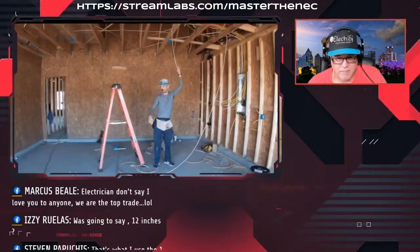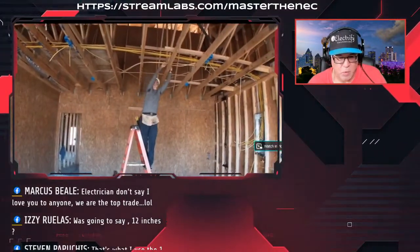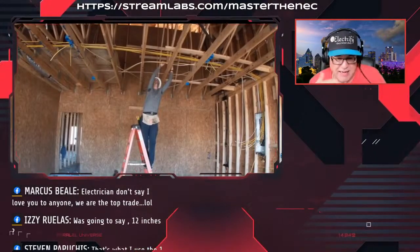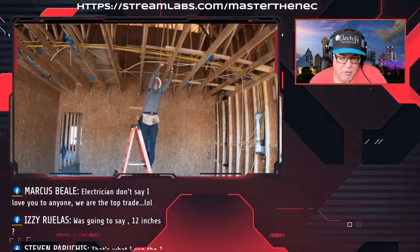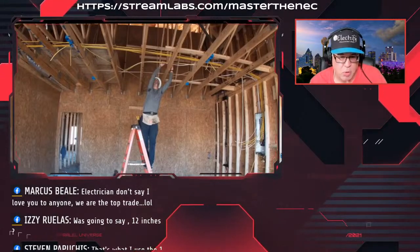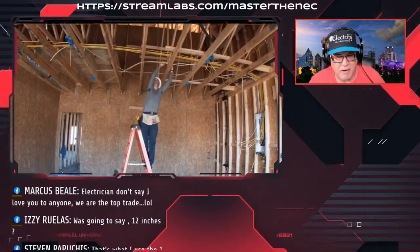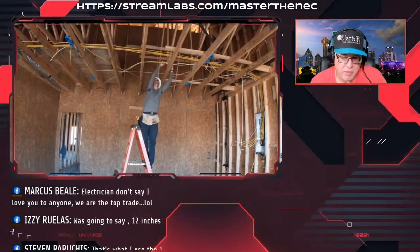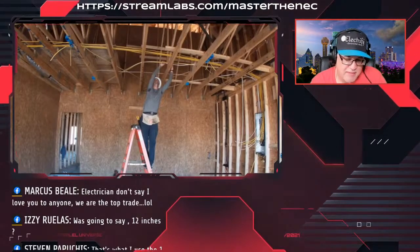Smoother. You've got to constantly stay aware of how much wire you have pulled out. Yeah, that is one tip I'll tell you. A lot of electricians, and I would see jobs or even my guys back when we were doing it, pull it out of the actual coil from the inner part of a 250-foot roll, which puts a twist on it. It's a pain in the butt, and it's nasty to have to sit there and flip it out. So much easier to pull it from the outside and put it on a Lazy Susan or put it on something that spins so that you have it coming off nice and neat.